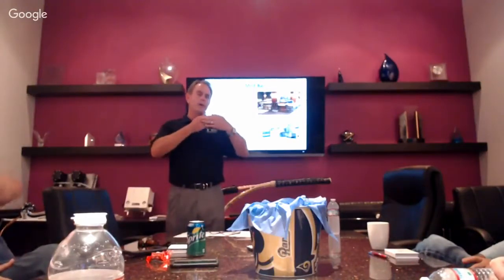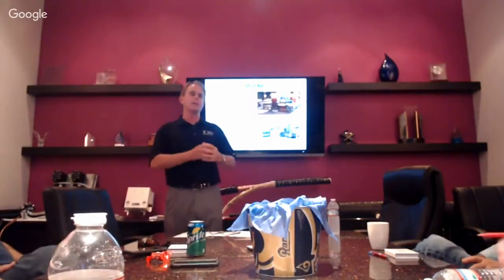So a very simple option, a no-charge option, is removable die wall. Removable void panel, so that they can be taken off from the bartender side. It's a great place to locate a tower. If the beer bundle and the tower's over the die wall and the beer bundle's coming into the die wall, then put the tower over a bottle cooler. Great place to do it. Because that rolls out of the way, you take that void panel in, and you've got all your connections right there on the bartender side, and if you have a removable panel on the customer side, you can pull it off there as well.